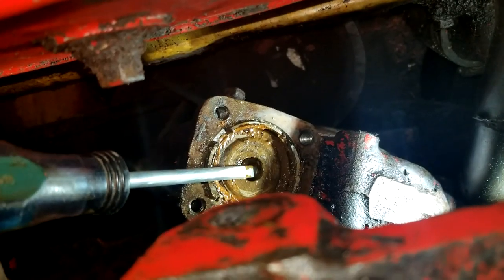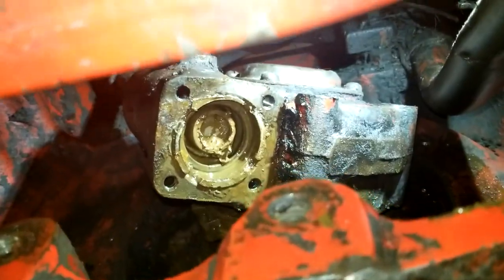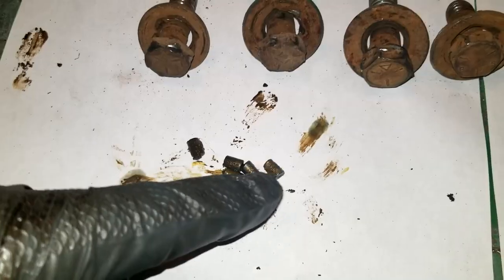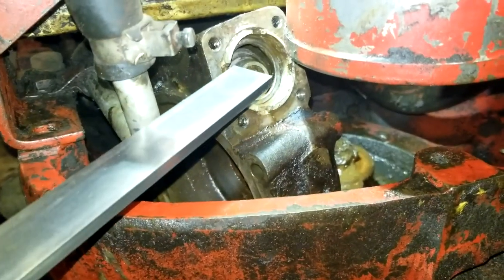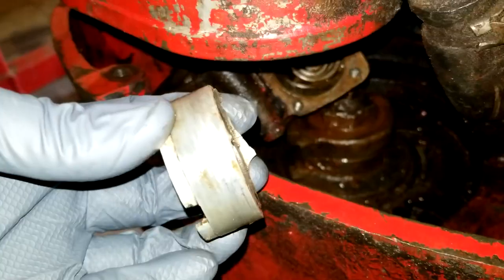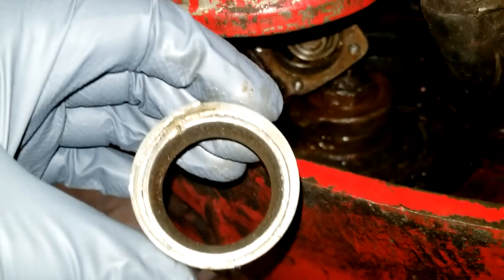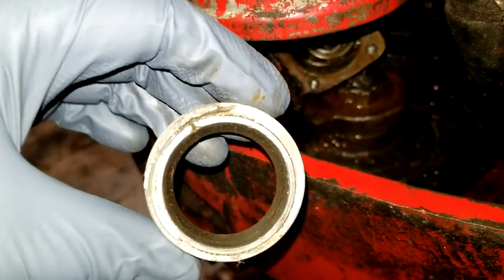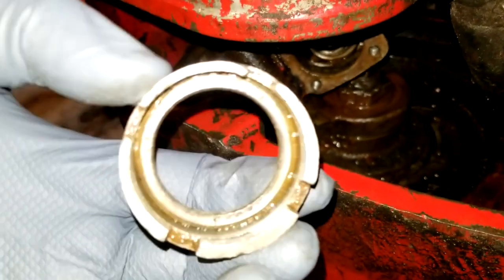And back to the end of it here, what's behind there, this little thing. I dug around a little bit in there and I got these shards out of there. Not to mention all these little rollers from a bearing in there. Looking at this piece, it's not obvious right away what it does, but after taking it out, you can see that it's non-concentric. And so that means that when you turn it a bit, it basically adjusts the engagement of the worm gear against the main gear.